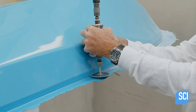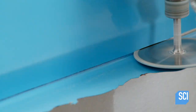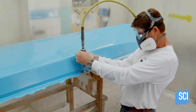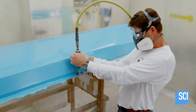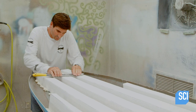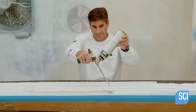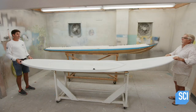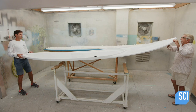An assembler trims off the excess laminate using an air cutter fitted with a diamond cutting blade. He levels the foam stringers with a file blade, ensuring the tightest possible fit between the hull and deck. He applies expanding foam adhesive on the stringers before he places the deck on the foam with the help of a co-worker. The adhesive quickly binds the parts together.